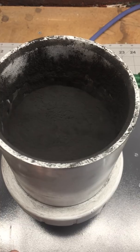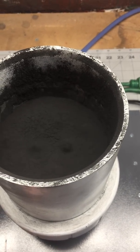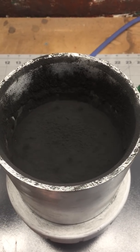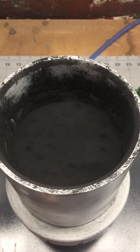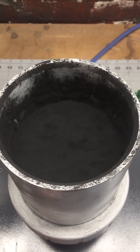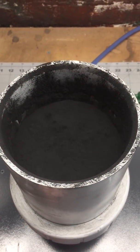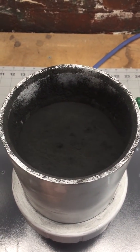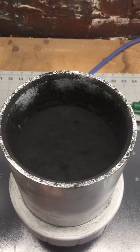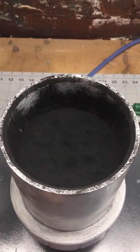And what we'll actually start to see is the powder coat begin to puff up a little bit, and I'll actually be able to increase the air supply. We're going to start to see some smaller bubbles form more randomly across the surface, and this is exactly what we're looking for. As the air is moving up through this powder, it's actually suspending the mass of the powder, allowing it to behave much like a fluid. There we go, that's looking great.